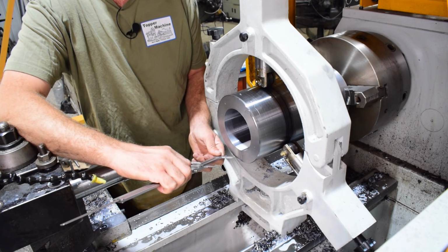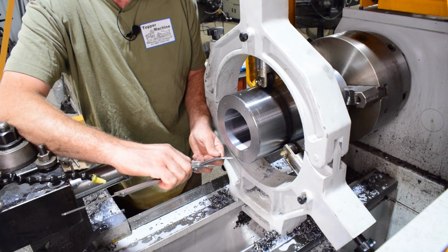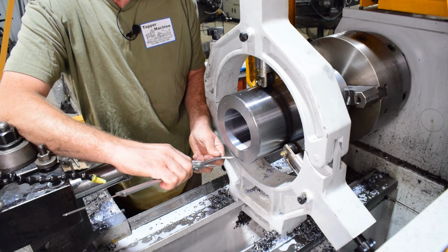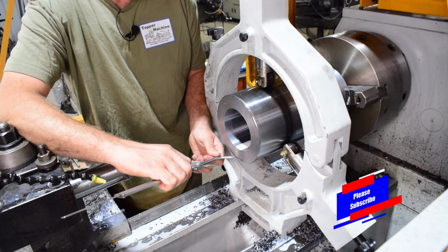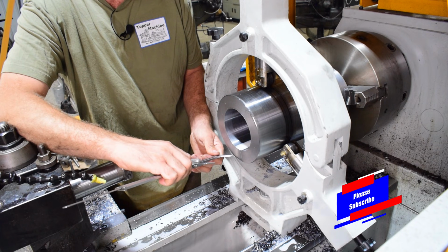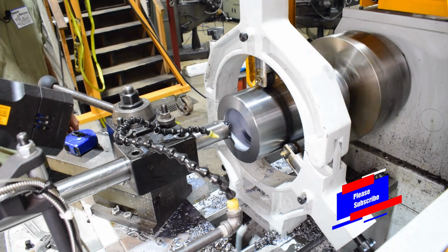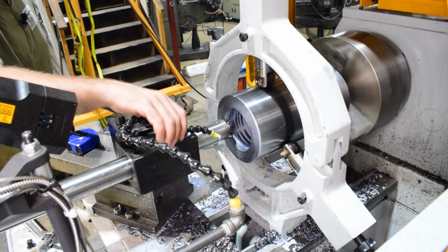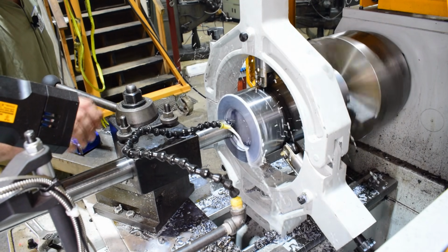But it's the material the customer brought me, and it's what he wants, so it's what I'm gonna have to use. I think I'm gonna shoot for just under 4.5 and clean it up. Maybe I'll shoot for 4.75, and that might be pretty safe. I should be able to clean that material up. Put the coolant back on it.